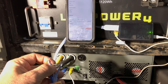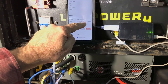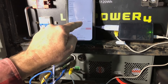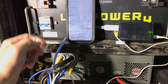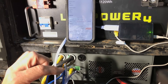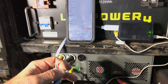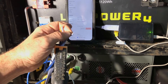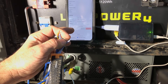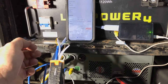Right here you can see a quick demonstration of how responsive the Solar Assistant app is. You can see, as crude as I'm doing this — basically ripping apart a couple of old cables and touching and releasing one of the pins — whether it's the receiver or the transmit pin, the app immediately recognizes it and reconvenes the connection and the communication just as soon as you connect or disconnect the pins. It's pretty impressive. I was just doing this to make sure I was on the right track with the correct pins before I start making a nice, pretty cable, which is up next.